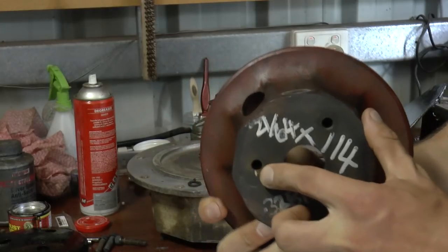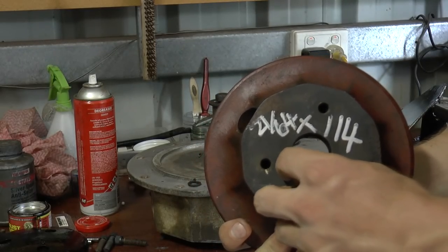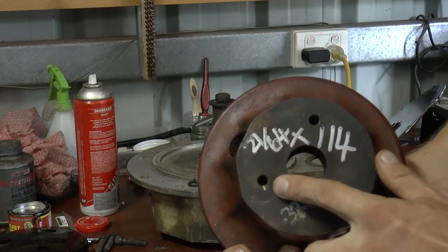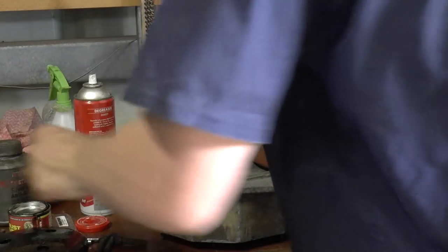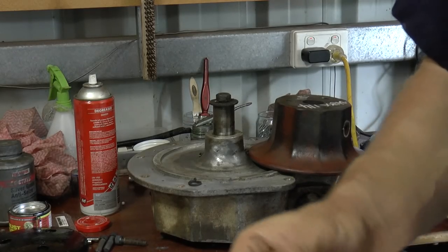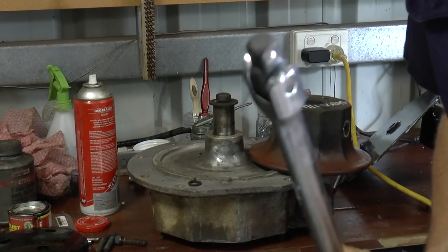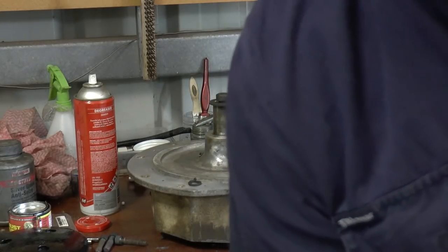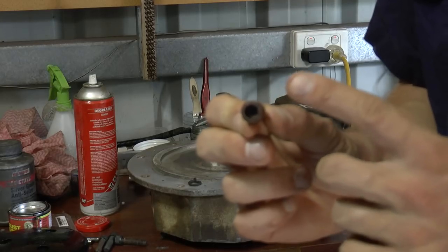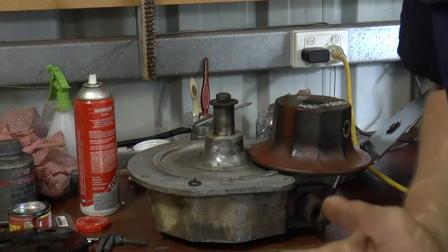What I had to do was try and use an easy out — drilling into the thread that was in here, using an easy out which is like a tap or thread remover, then using a spanner to try and pull the thread out. However it was getting dangerous because I was putting a lot of pressure on it and I thought the easy out would break. I applied some heat to it but that didn't make any difference. I tried soaking it with Penetrene — that didn't work either. I ended up getting a socket and knocking it over the top, and went out and bought myself a half-inch breaker bar — that didn't work. I also went out and bought a set of imperial allen key bits to try and undo it, and that didn't work either.